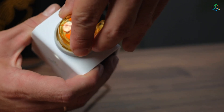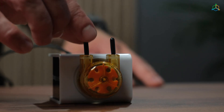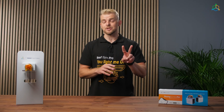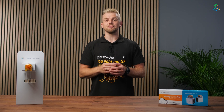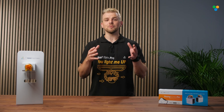Fit the Dosing Pump and insert, twist and lock the pump head. Remove the black plugs from the ends of the hose and insert the cut hose. The length of the hose should not exceed 2 meters, as this may affect the precision of the dosing. Insert the ends into the container with the fluid and the sump. The liquid is taken from the right hose and poured from the left hose. Once this is done, we can mount the pump in a convenient place and proceed to the next step.